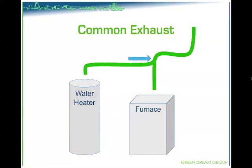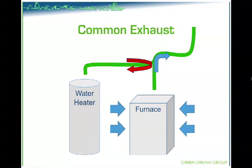Since they're commonly vented, what we're going to do is first kick the water heater on by itself with all the rest of the house at the worst case we can get to with just the exhaust fans, before we get to true worst case and kick the furnace on. So we're going to test for spillage and draft without its big brother, and then we'll test it again with the furnace combusting as well to see if that helps or hurts.